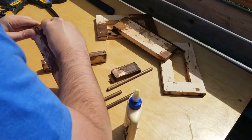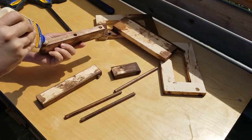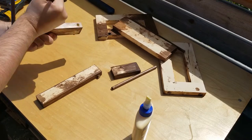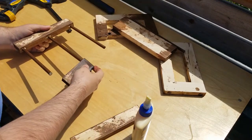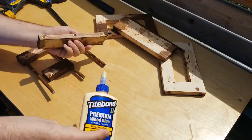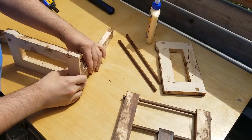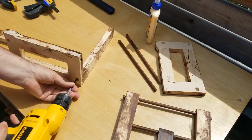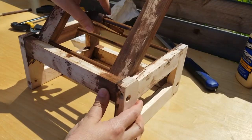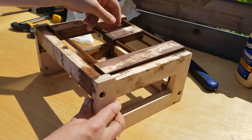Time for a final assembly. We're gluing in the dowel rod nubs into this piece and gluing in the three dowel rods, but we're not gluing in the middle brace piece — that needs to be able to rotate and flex to hit the right angle for the lifting function. The other piece that won't be glued in this assembly is the dowel rod nub connection into the base structure. It will be held in tight by the two cross pieces being screwed in, and the friction fit will allow it to rotate up and down for the lifting assembly.